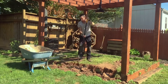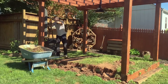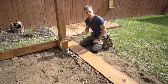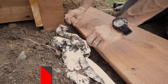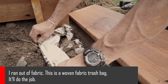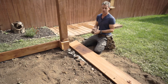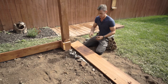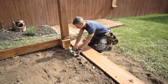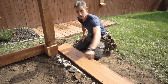The movie where Mark digs a hole happened before all this. I got all this level and graded, and to add a little belt and suspenders, I swiped a technique from perimeter drains inside the house. I made what I call an ag bag — a bag of aggregate, essentially a sock of geotextile fabric, landscape fabric, that I filled with stones and wrapped up.